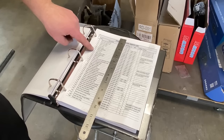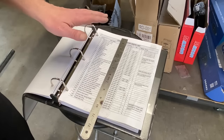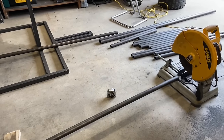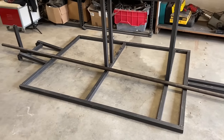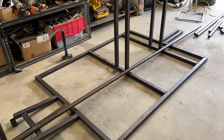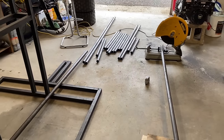C6, 7, 8, and 9 are all 120 because we're going to bend it and we're going to sleeve it. So don't just start taking the measurement and cutting the tube — you might waste some precious tubing. This is kind of in a build order rather than a cut order. Something that worked out for me on the last build was that I only cut and fabricated the pieces I was using that day. Instead of doing all the bending and all the notching in the same day, I just did all the pieces I was using. I'm going to cut, bend, and notch all the pieces that are just going to go on the main jig — it makes it more fun and makes for a nice day in the garage.